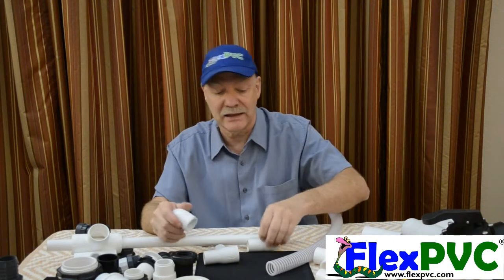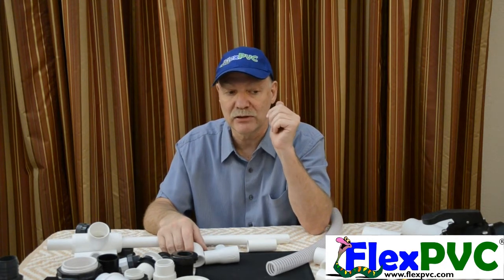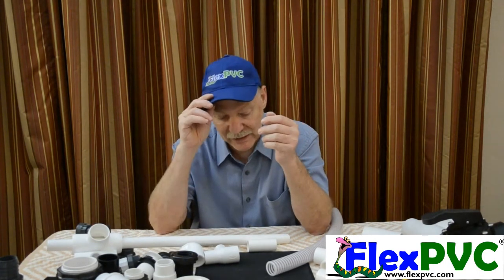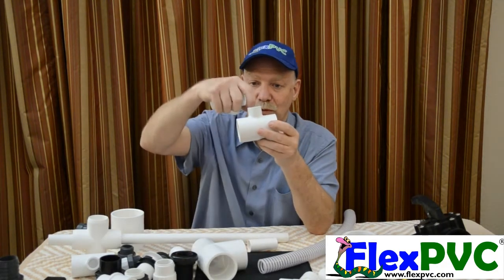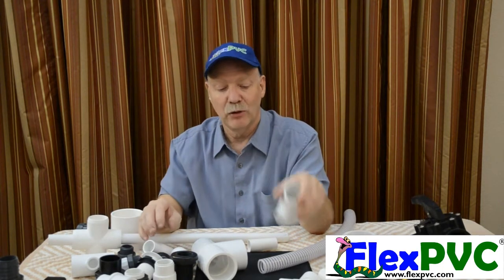Some fittings are accidental — it just so happens they will fit. When they initially designed the mold, they didn't intentionally do it, or maybe somebody did, but it's not sold that way. But we have several fittings that are a one-inch spigot or three-quarter spigot on the outside, just out of coincidence. Venturi just throws people off all the time. These are three-quarter inch slip socket or one-inch spigot. I know I'm repeating myself a lot — but this is something that really a lot of people struggle with, so I wanted to make a video about it.